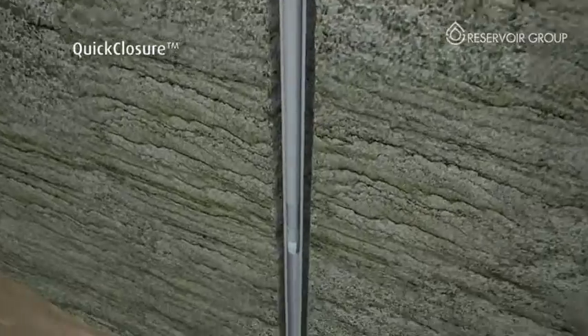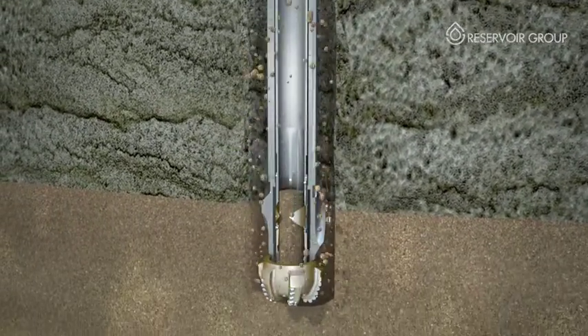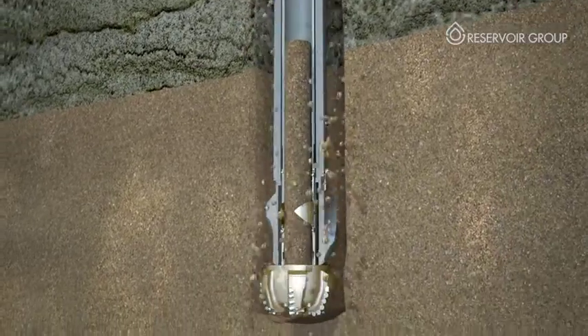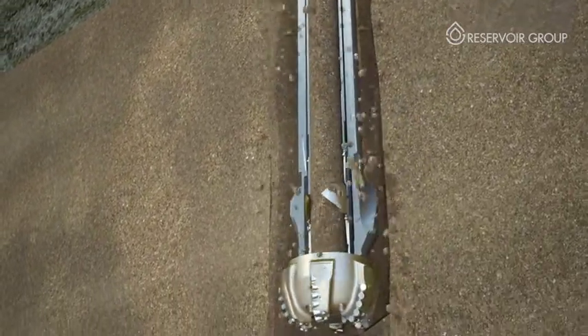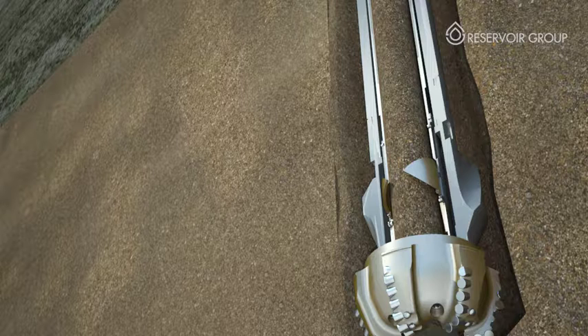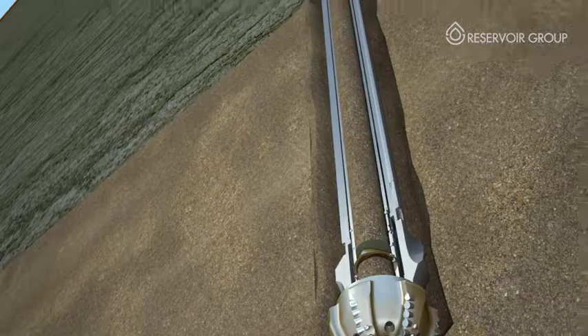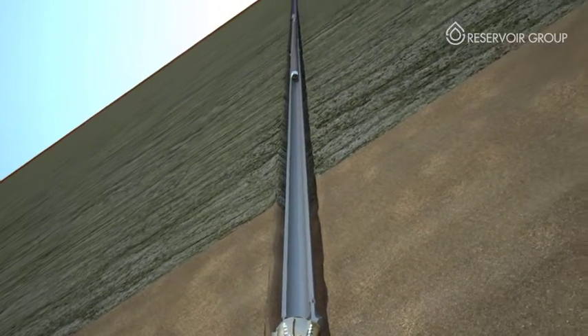Quick Closure is purposely designed to fully close the inner tube at the end of the coring run, ensuring full retention of the core inside the inner tube during the trip to surface. The system is hydraulically activated and is not sensitive to flow or pressure changes during the coring process. When it is time to activate the Quick Close shoe, a ball is dropped from surface to vent the hydraulic cell. This generates an axial movement from the inner assembly, forcing the inverted clamshells located at the bottom of the inner assembly to close and trap the core inside the inner tube. A conventional spring catcher remains part of the assembly to guarantee successful recovery, should a harder formation be encountered.